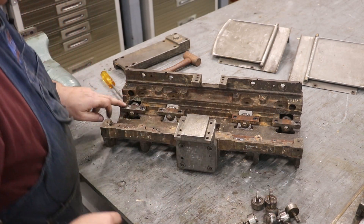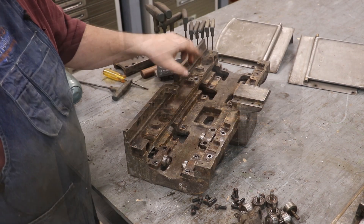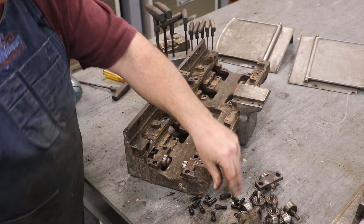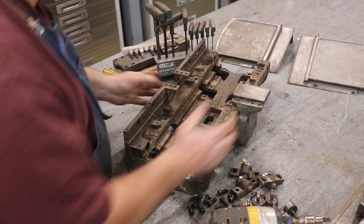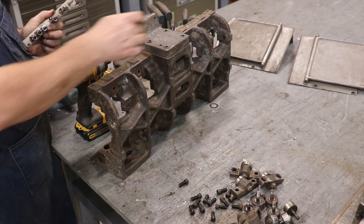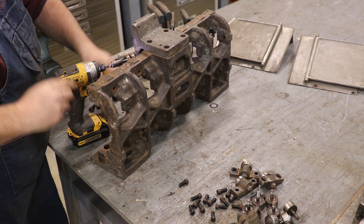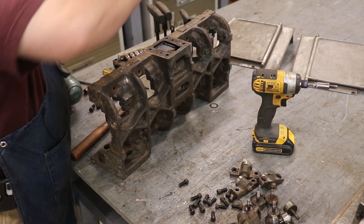Got all those out. These are in here with a little saddle, each one sitting in with a socket cap screw. I've been taking out these bottom bearings — they're in here with a couple of socket cap screws and I've been using my impact socket wrench to speed this up. The back piece comes off — there are a couple of socket cap screws holding that in place. And it looks like there's a couple of pins holding this in place. I had to tap it off — looks like only one pin in the end, since it's been off before.